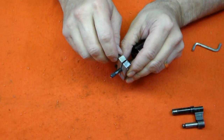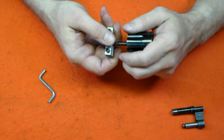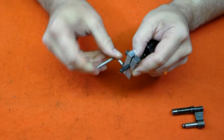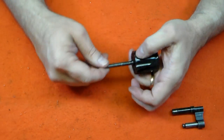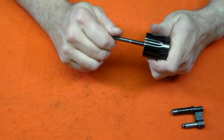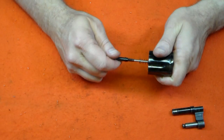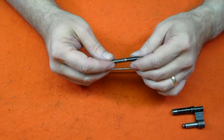If the rod is very tight, it's a good idea to put a couple of dummy rounds into the cylinder to support the extractor. This tool is homemade — it is aluminum so it won't scratch the rod. Similar tools can be found at Brownells or MidwayUSA. The extractor rod is spring-loaded; it has a very light spring, but keep a little pressure on it as it unscrews. With the extractor rod removed, the remainder of the pieces can just be pulled apart.